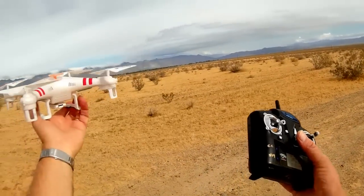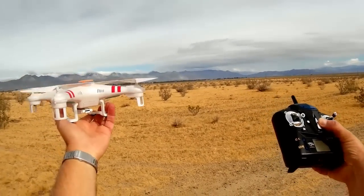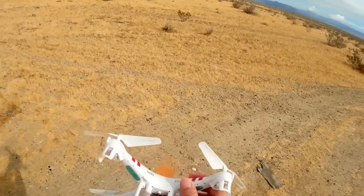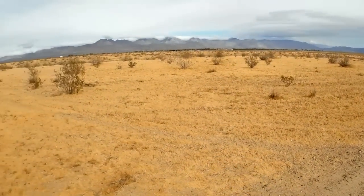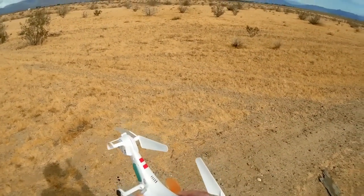I'm giving it a slow throttle and then turning off the transmitter — one thousand one, one thousand two, one thousand three. Good, it shuts off. I just wanted to verify that it does shut off automatically when it loses signal. To rebind, you have to unplug it and replug it back in. That's what I wanted to verify.